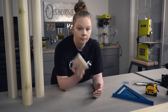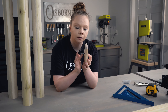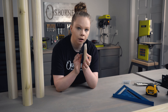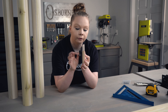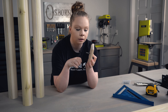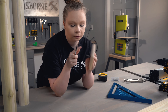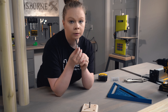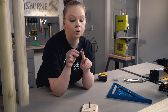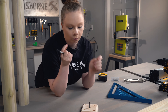Before I move on to installing my last block, make sure when you're installing the bolts that you don't just stop at the end of the wood threaded part — you want to countersink it enough that it ends up flush with the wood plate when you finish installing everything. An easy way to make sure you drill far enough in is to mark off your drill bit with a piece of tape. I've marked off an inch and a quarter deep so I'll know where to stop on each leg to make sure I have a deep enough hole.